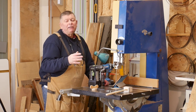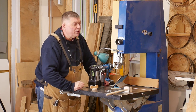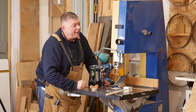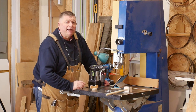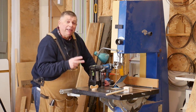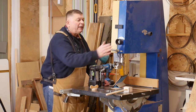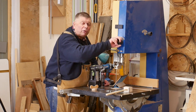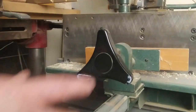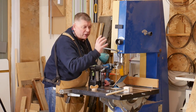I've had this machine since it was new, since they first came out. This is one of the first ones that were produced — 1998 it says on the machine plate. And it wasn't long after I bought this that they changed two things about the machine. They put a brake on because the stopping time regulations changed, and they altered this knob. Instead of this big chunky cylindrical knob, they put a tricorn knob on, like I've got on my mortiser, and it made it much easier to turn.